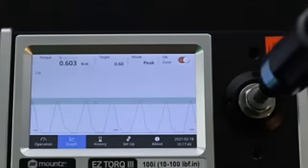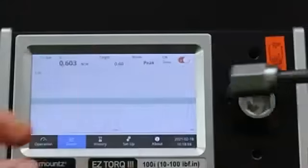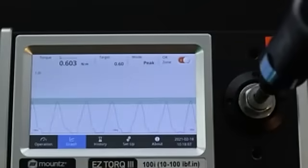Physically and mechanically, the tool cannot over-torque the application. So this makes this type of tool a very safe type of tool for the assembly. Not only that, but when we developed these tools, we mounted the cam in a very specific way that will eliminate end load and side load as well, basically eliminating any operator's influence on the assembly. So what that means in real life is that you give this tool to anybody, it will deliver the same torque again and again.